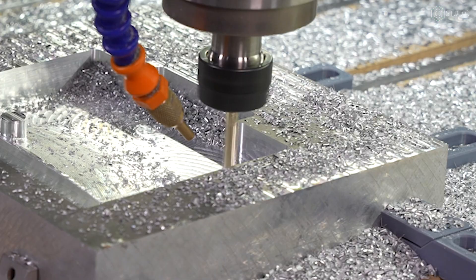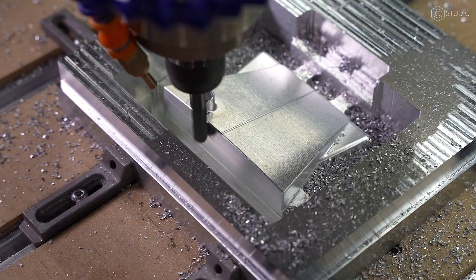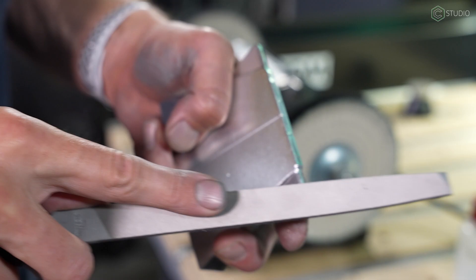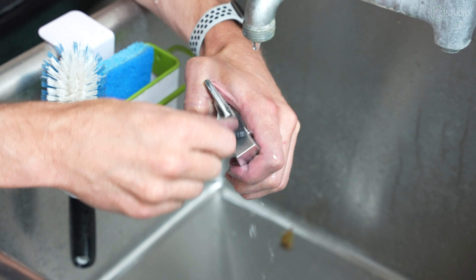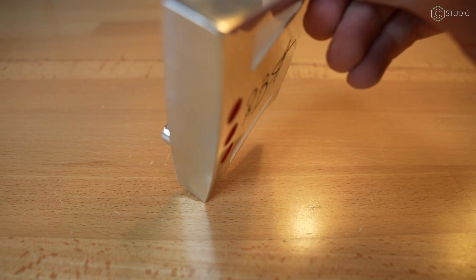This is the end result of version number three and what you saw earlier at the golf course — this thing was really nice. In the middle of the project I switched to three-eighths tools because I had the reach with quarter-inch tools but shattered one of them due to too much chatter. If you're going to do this on any machine besides the HDM, I think you should change the design so you don't have to go quite so deep into the pocket. I went to three-eighths — a flat and a ball to make the face — and it worked out beautifully. This one-off version did require a bit of filing, but as you refine your CAM settings you'll eliminate that step. I then moved to Scotch-Brite, several high grits of sandpaper up to about 2,000, and finally on to the polishing wheel.